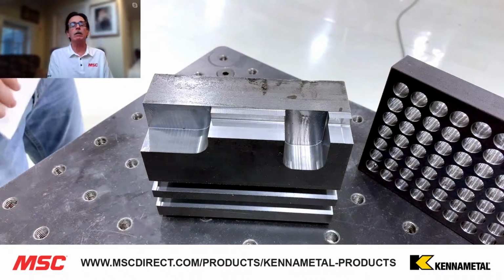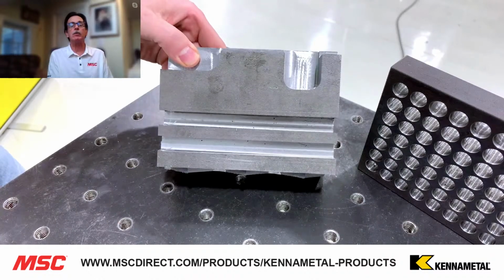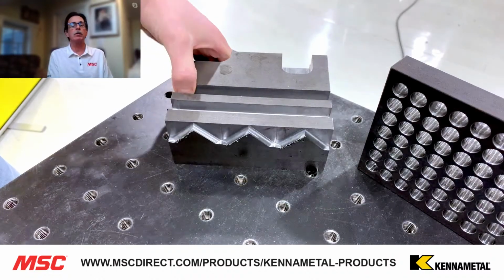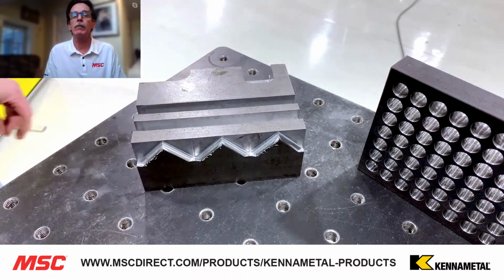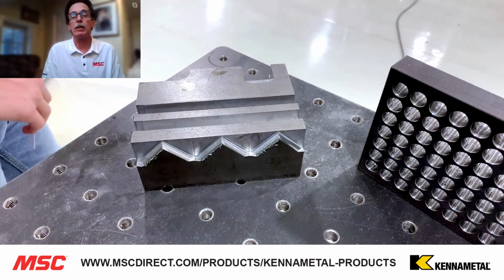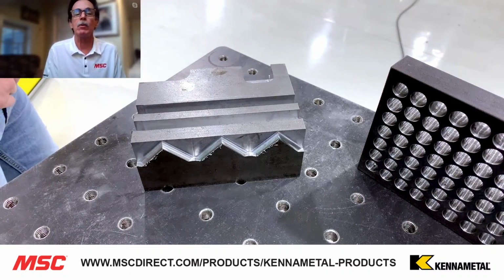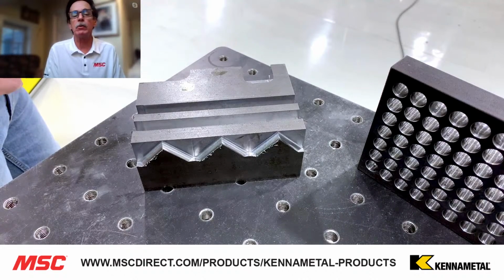The tricks in this cutter just allow you to be a lot more aggressive in your feeds, your speeds, your depths of cut, the approaches with the plunging. If you ever plunge with an end mill, you've got to back off. You drill with this tool. So that's eliminating a process. You can do those ramps, so you can ramp into the bottom of your pocket and create it.